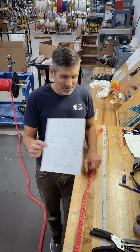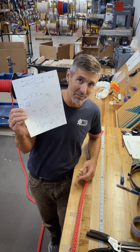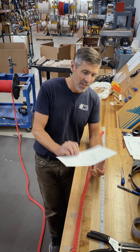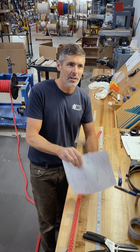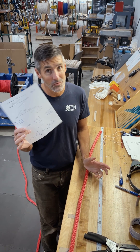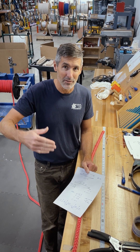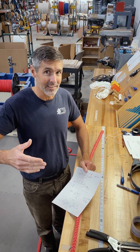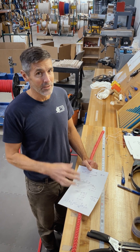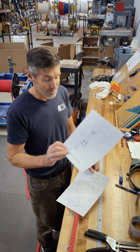In order to do these, what we actually come up with is what we call a recipe or a build sheet with our special nomenclature notes on how to measure everything, where to cut it, how to mark it, how to taper this. So it's all written down and documented, and this is really the only way that you can do it so that we can get consistency over every splice — so that every length is as close as possible to the exact same length as the next one and dialed into the specifications. Even if it's just a handwritten copy, we get it as close as possible.